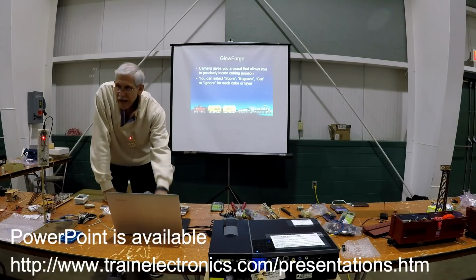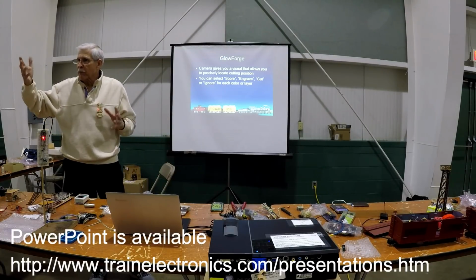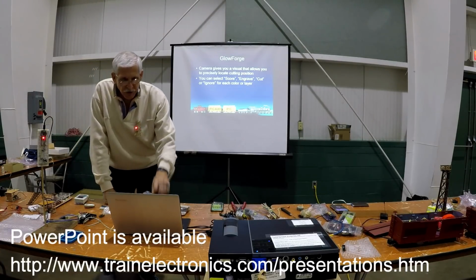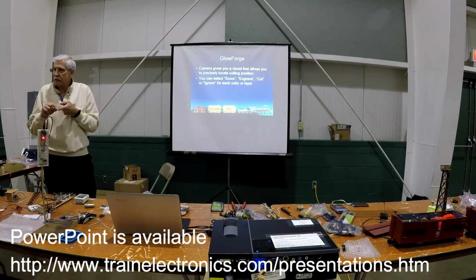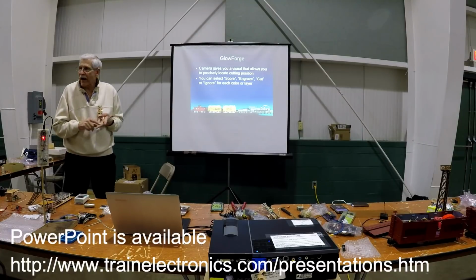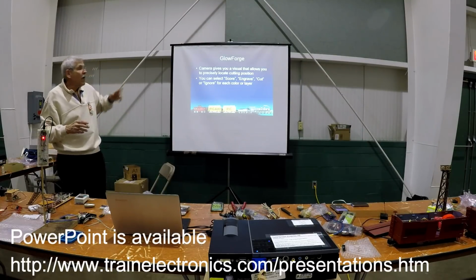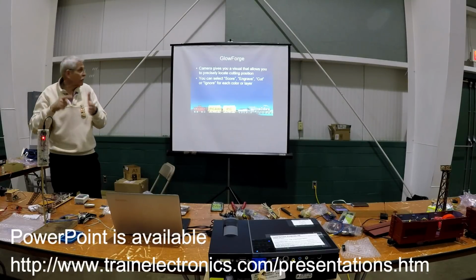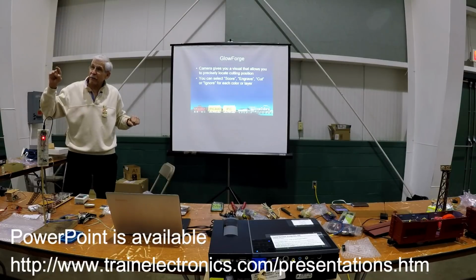And once you get that into their software, it again takes the colors and breaks them apart. And you can choose from that whether you want to score a line, which is a real light cut, whether you want to engrave, which is what I did on that PRR stuff down there, we'll get to that, as I said, in a minute, cut, which would be the outline, what goes clear through, or ignore, because there are times that you have something in there, oh, I don't really want to cut that part, so just ignore it.